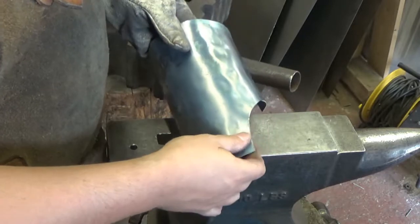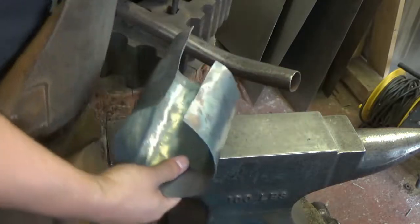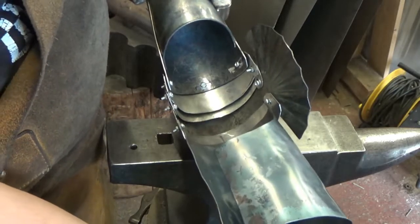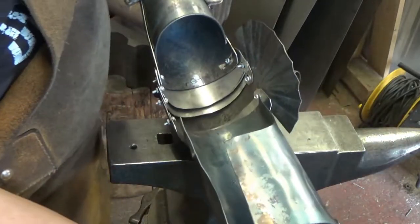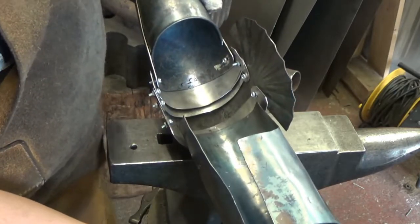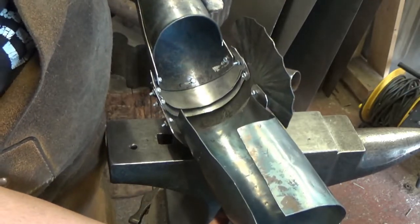We should get that sort of non-bloated look of muscularity, or hint of muscularity, that we're after. It's a bit closed up at the moment - that'll be about that wide by the time we're done. But I just wanted to offer it up quickly to the arm that it's going to go with and just check where I am. Remember, the middle isn't the middle of this piece of work - thereabouts is our middle line. So those edges on the lame and the rear brace just about meet, and we can see we're a bit small, which is kind of nice. I prefer it that way - it makes it a lot simpler to open these things up and get them to fit. So I'm going to spend a bit of time just planishing and tidying this up and then we'll come back to it.